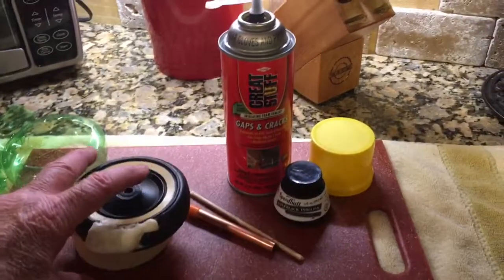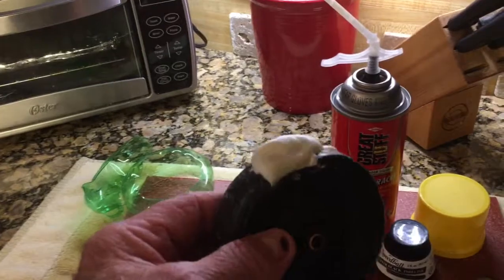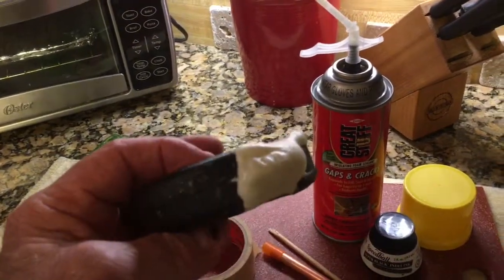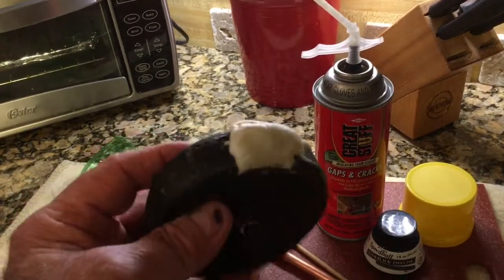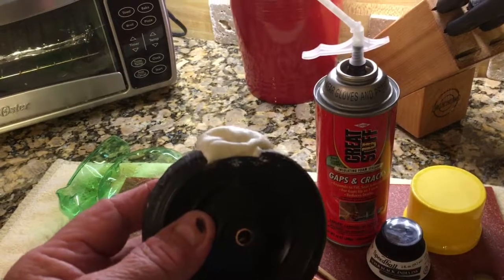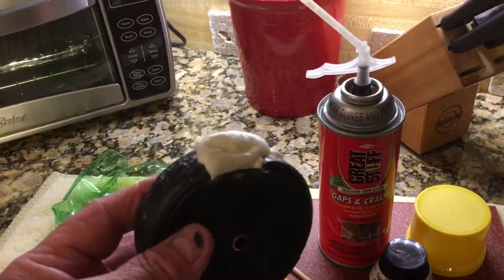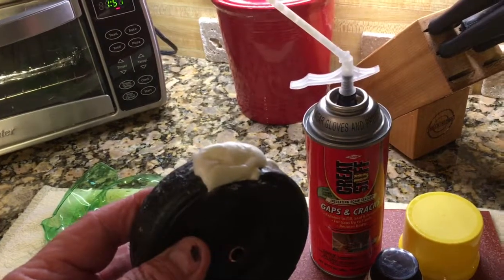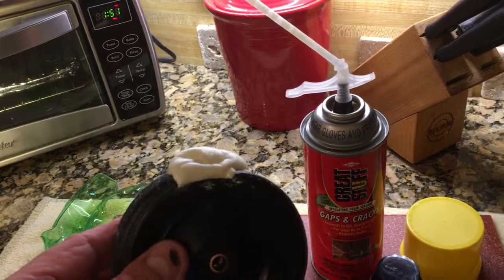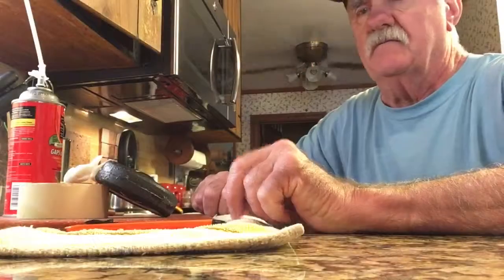The foam has set up hard enough, or sufficiently enough anyway, that I can now trim it. So even though I tried to leave it a little bit low, it expands as it dries, so it's expanded outside of the surface area of the wheel. I need it cut down, maybe 1/8 or 1/4 of an inch below the rim to give an area for the epoxy to form the hard outer layer. So that's what's next on the list.